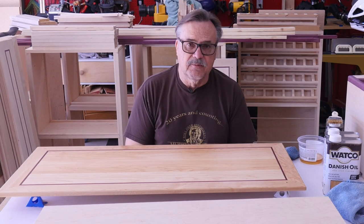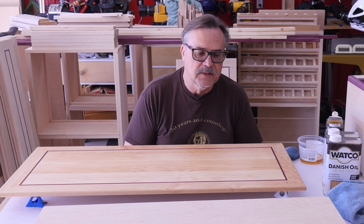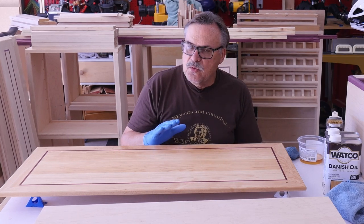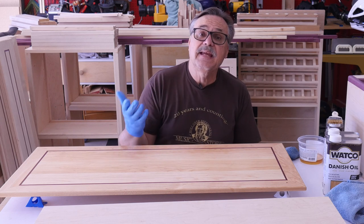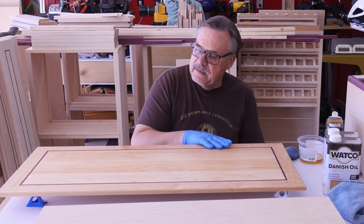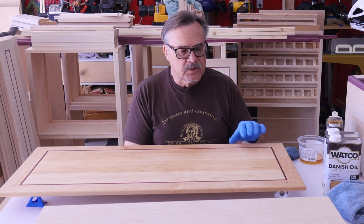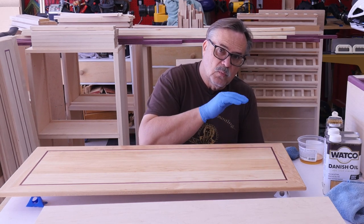That's one of the reasons I'm picking this finish for my cabinets. The cabinets we have in there now were shot with lacquer — done by a professional painter when we built the house. I did make the cabinets, but we had a professional painter that did all the lacquer. That lacquer has chipped and cracked and worn through. There's really no way to fix it unless you sand the whole thing almost to bare wood and then refinish. And the problem with that is if they stained it, you've got to try and match the stain. I'm using natural Watco oil here so I don't have to worry about the stain. It does darken the wood and gives it a golden color, which I like. Over time it'll age and get a little darker. The purple heart will get a little darker too, but it'll still have the purple color and still separate.